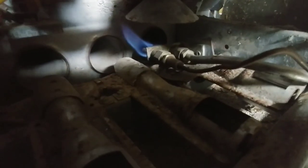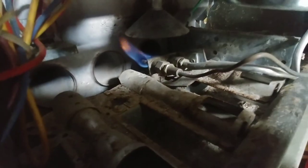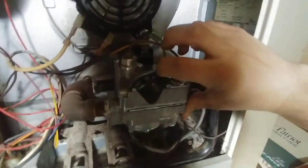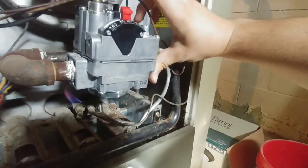That is running. Now we're going to hold it for probably about 30 seconds before we let it go, because it's got to have time to warm up that thermocouple. It's been about 30 seconds — now we're going to let go of this, and the pilot stayed lit.